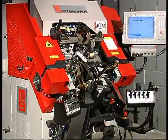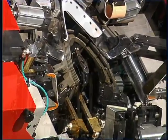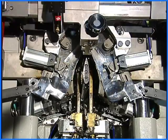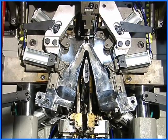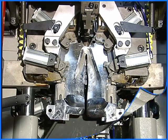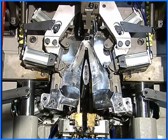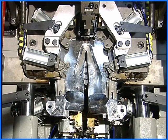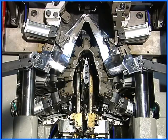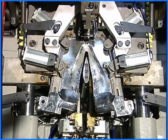Numerical control technology sets the closure of the wipers according to the last being used. Here we can see some examples of wiper closures taken from the many available. In one example, the wipers move forward and close simultaneously at the end of their run. In another, the wipers close first and then move to the end of their run. Here we see the wipers moving down — open for a stretch, then closing and moving down for the rest of their run.